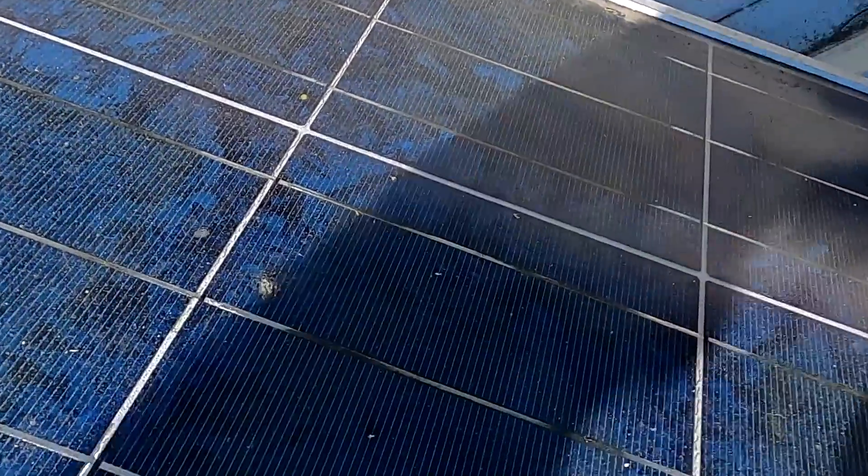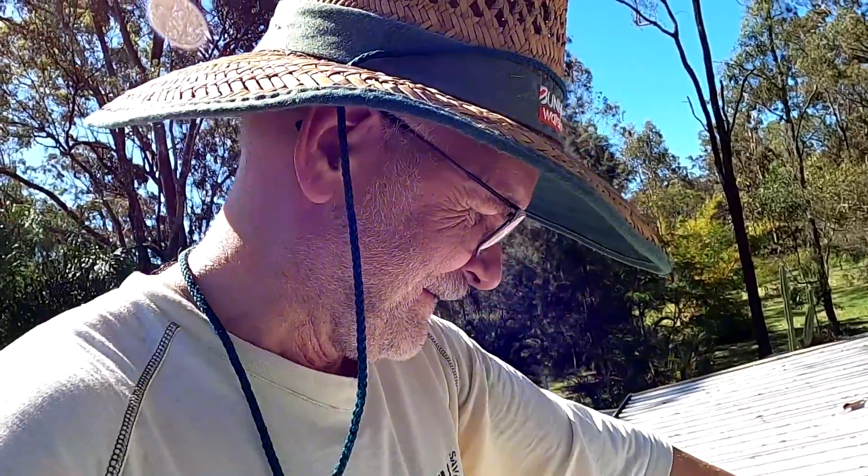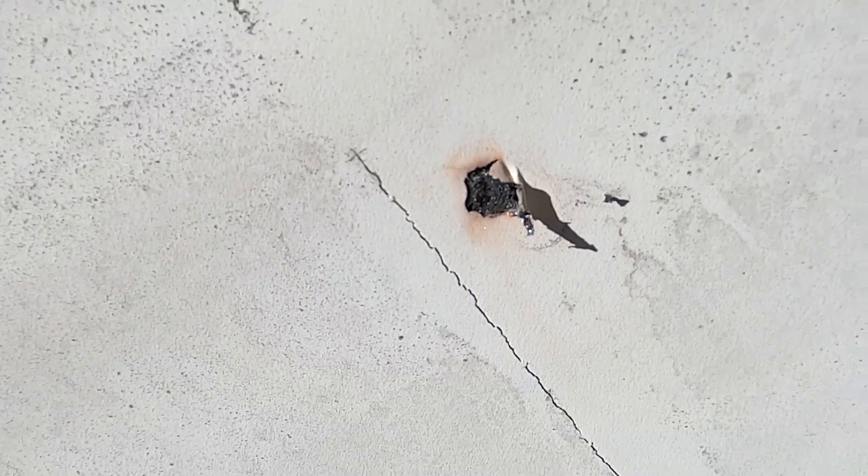Have a look at this — can you see that? That is a hot spot. There is a burn mark on one of the Canadian Solar panels. These are the ones which are cracked — you can see the cracks there, everywhere. And this is the main reason for the solar upgrade. I can't get these sort of panels anymore. But this one is a serious burn mark, a hot spot which could cause a fire. Glad we are not using these panels anymore.